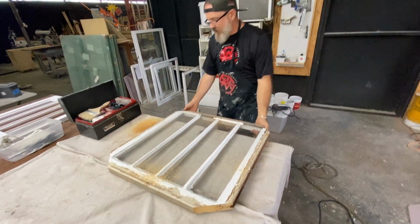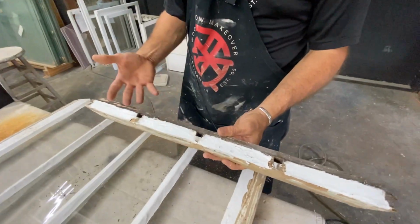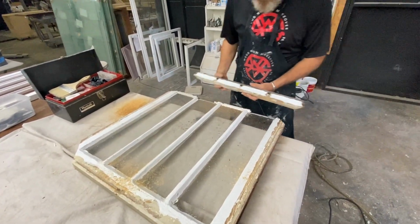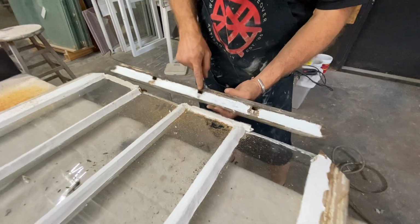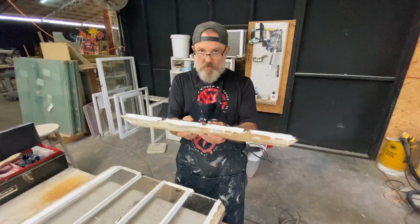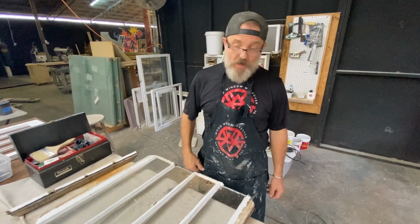Another skill I obtained from my days framing houses. Here's something really cool. You know you have a quality sash when the muntins of this double hung sash are nailed from top to bottom. And this had a nail in it. See how the tenon goes down into that mortise right there? That actually serves to hold the bottom of this up so gravity doesn't cause it to bow. So this was a quality sash installed in the wrong way in a weird spot.